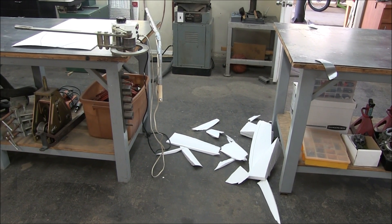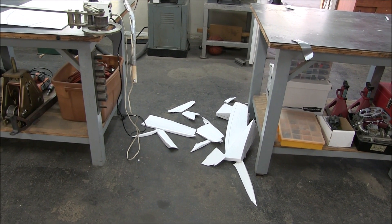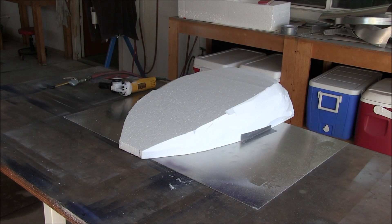With the hot wire cutter I've trimmed off some of the excess pieces, and now I have a little setup outside where I'm using the angle grinder to add a little bit more shape. Here's my setup for the angle grinder — I have a hundred grit disc on there and an air hose to blow off all the crumbs after I'm done.